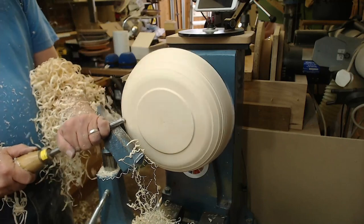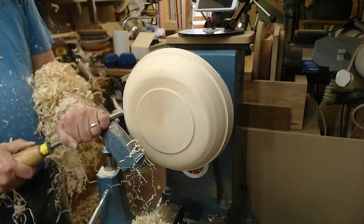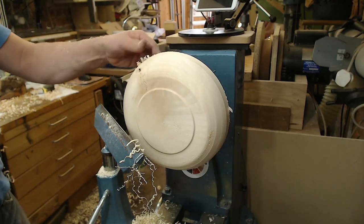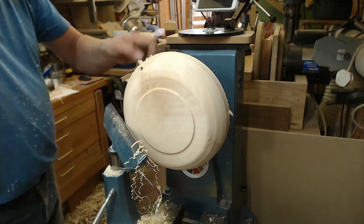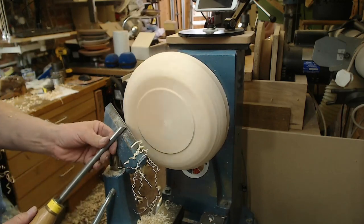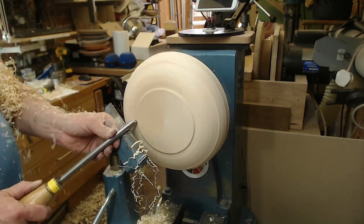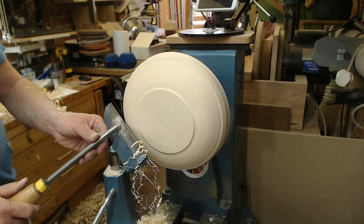You can see I'm refining the shape. I don't mind taking a few cuts to get the shape broadly established and then sweeping around with a finishing cut or two, but there are quite a lot of tool marks here, mainly because it's bouncing over that ridiculously annoying knot and there's quite a bit of tear out on the end grain as well. It's amazing what 120 grit sandpaper will get rid of, but I want to focus on getting the shape a bit smoother and more flowing.